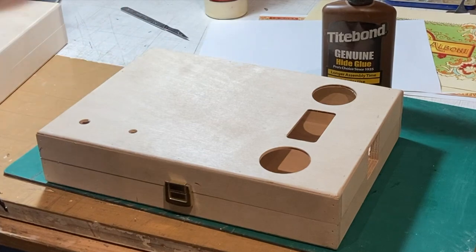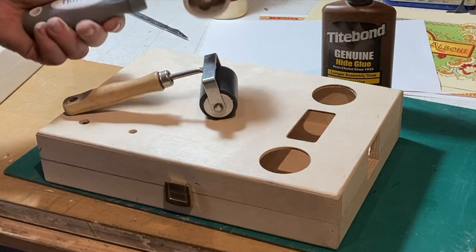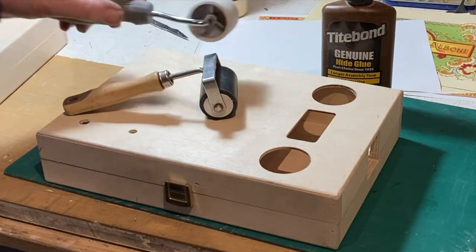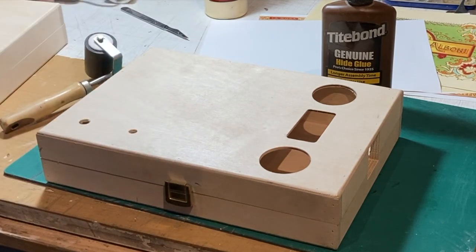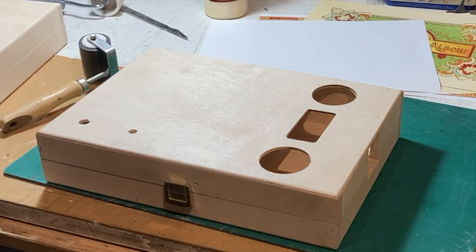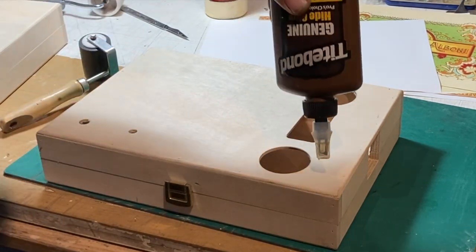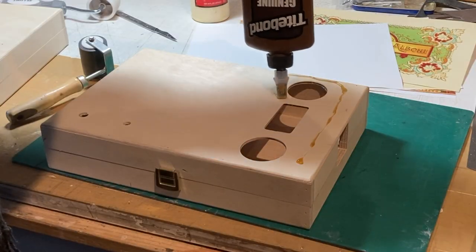So what we do — we're going to use this stuff and a roller. That's an ink printing roller; that's a regular wallpaper seam roller with a soft sleeve on it. Either of those are fine. We're just going to put a little bit on — the key thing is not to overdo this. You only just need to get this tacky.